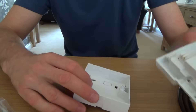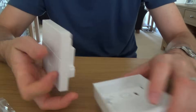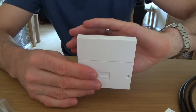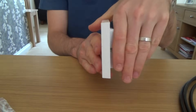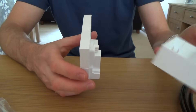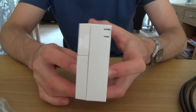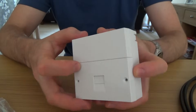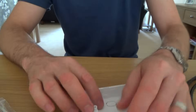These sockets are sold with and without a back box. If it's to be flush mounted — going straight on the wall with a metal electrician's back box hidden in the wall — then you don't need the plastic back box; just plug the faceplate straight onto the wall. But if you're doing a surface-mounted job on the skirting board, you'll want the version that includes the back box.